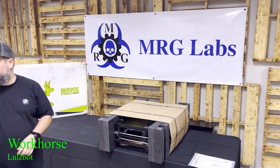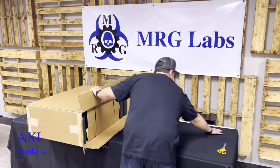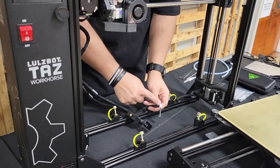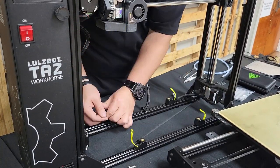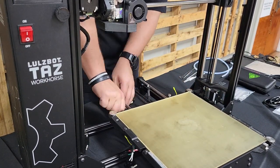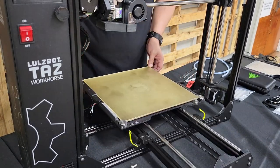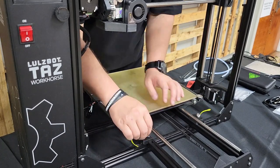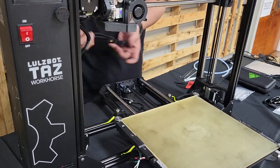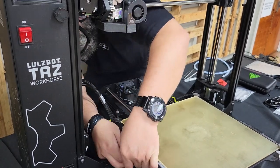The setup for both of these is virtually the same and involves unboxing and laying out all the parts on a table, followed by pulling the wires out of the way so they don't mess up the end connectors. Now you unscrew the four bolts on the bottom that typically hold the bed down. The Taz Workhorse comes with these flexible little strips that make it so you don't lose the screws, but in reality they're more of a pain than what they're worth, so I typically remove them and store them in the toolkit. The easiest way to not lose them when you have it apart is to just simply put them back in the printer. From there, we screw down the bed in all four points with the motor in the back of the machine, and then connect the two wires in the back of the bed — one to the motor and one to the other end stop sensor.